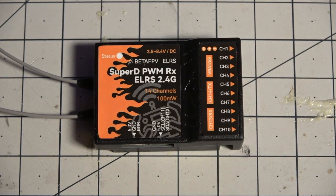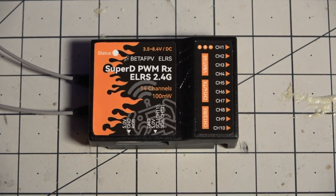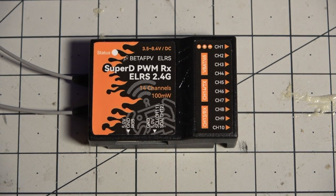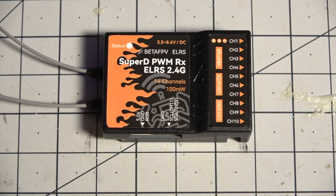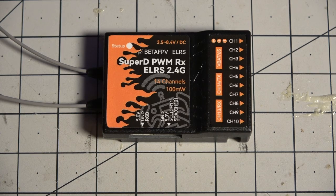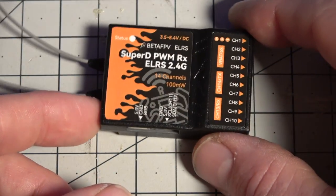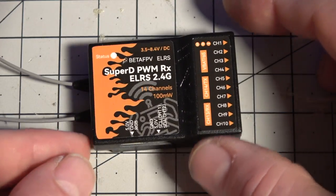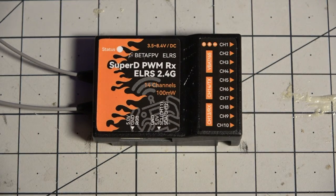It's always good to have a diversity receiver setup for fixed wing or quadcopters — some of the best setups have dual receiver configurations. You can also do dual cam setups, switching between analog and HD on a transmitter switch; INAV supports that. It supports USB-C and has built-in WiFi so you can make configuration changes in the app without hooking it to your computer. This receiver comes in three frequency options: 2.4 GHz, 915 MHz, and 868 MHz. I'd choose 915 for long range; for a quadcopter, 2.4 is fine. My prototype shipped with ELRS version 3.30.